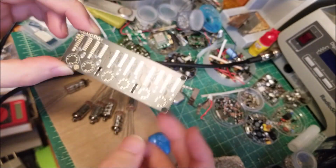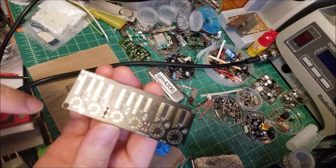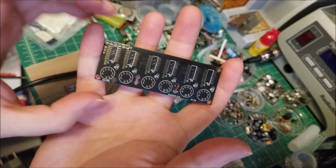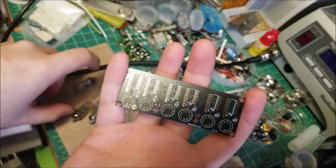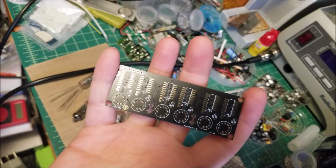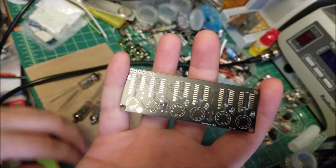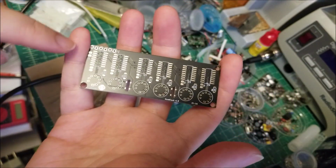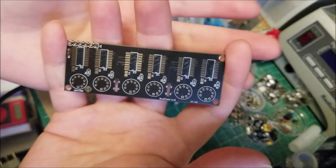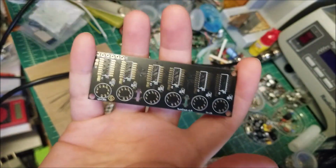So anyway, I guess what I'm going to do is start assembling this and probably do a quick test after I've soldered the first one, just in case it doesn't work. This is pretty simple. These are low voltage devices. They're just light bulbs, so they can run off of like 3 to 5 volts-ish. So I just have them run off of a bunch of chained 74HC595s, basically shift registers. And if you set the bit high, they light up. If you don't, they shouldn't.